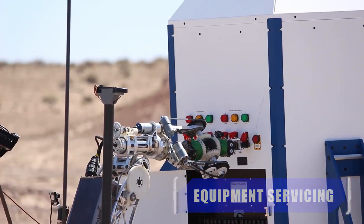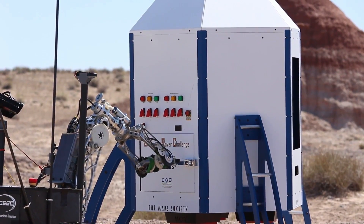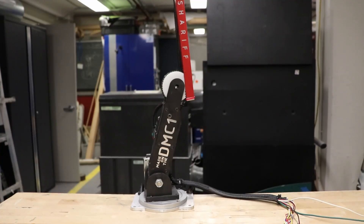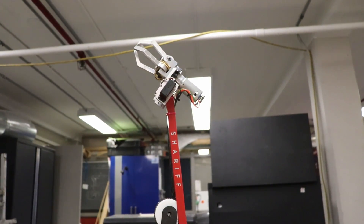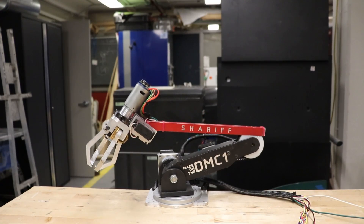In competition, the rover arm itself needs to be able to pick up small objects and tools and deliver them somewhere not too close by within an hour time frame, as well as interact with various switches, buttons, knobs, keyboards, and other things about 1 meter high off the ground. For that reason, I made my arm able to reach about 16 inches below its base to the ground and 16 inches above to reach the highest objects, and then fold up compactly with the stepper motors holding position for rough driving conditions.